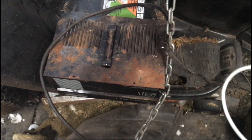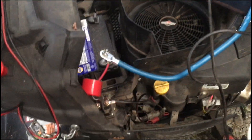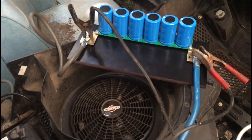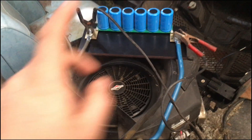It's finally time to test the supercapacitor module. I'm using a 15-amp charger, which is probably high — you probably shouldn't use more than 10 amps. I've already tried it once. I'm impressed that it was able to turn the small engine, but not impressed that it only lasted a few seconds. Some of the other YouTube videos — I think it's a different brand or amp-hours issue. It's definitely not able to turn a car engine; it's barely able to turn a small engine like this.